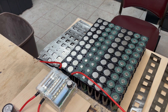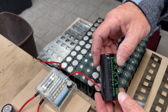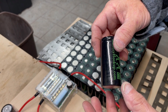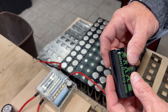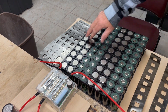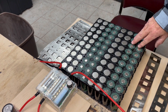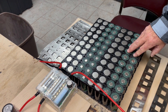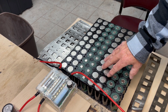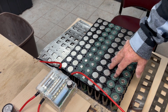This is the next battery pack I'll be making. It's made with Battery Hookup 32650 cells — 5000 milliamps each. I have a total of 80 batteries: 20, 20, 20, and 20. That's four series and 20 parallel, which gives me a total of 100 amps, and I'm going to have two of these. They're basically the same size battery packs, just assembled a little differently than the ones in the case.